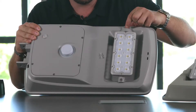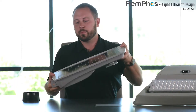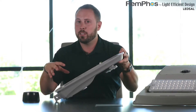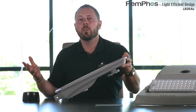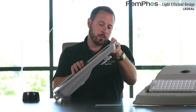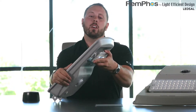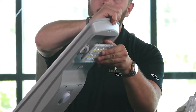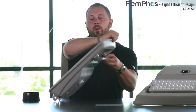There's a screw here that tightens down and this can be rotated. The purpose of that is so that when the fixture is installed at over a 15-degree angle — which is done for two reasons: one, to maximize the sunlight hitting it, and two, so that debris or snow would naturally fall off — the question is how we orient the LEDs to still point down to the ground. That light module can be rotated and then locked in place to pick the perfect angle so that the light is hitting the ground when you adjust the solar panel.